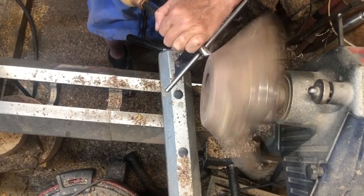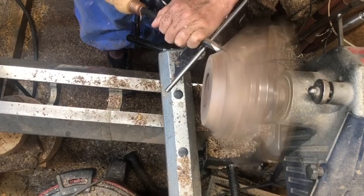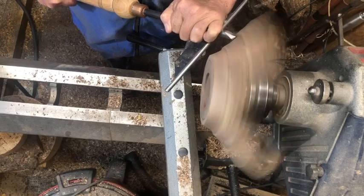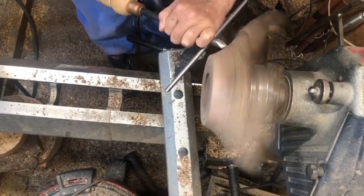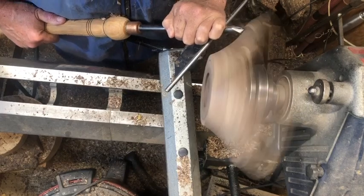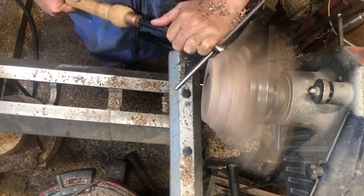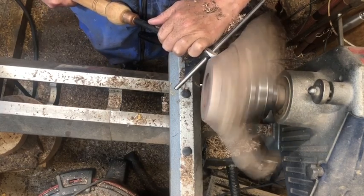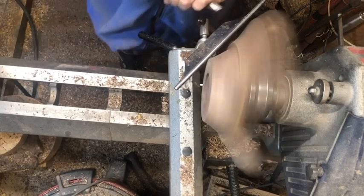I've been trying to do this, but I've gotten myself in too big a hurry. You'll see here in a minute, I had a little trouble. This was not a perfect piece of wood, and I had some consequences to using it. Getting a perfect piece of wood is not always going to give you the prettiest piece. This one had some checks and cracks, and I made the conscious decision to go ahead and use it knowing I could have a problem or two. Right there you see I've got a little ledge where I've gone up almost to the top of that one wing. I got rid of that ledge but started back at the bottom — still trying to make a nice smooth curve from bottom to top. I don't want steps or big transitions; I want a smooth curve, and that's what I'm working on.